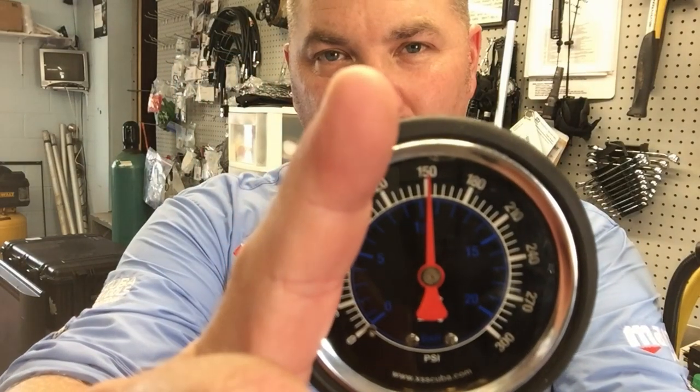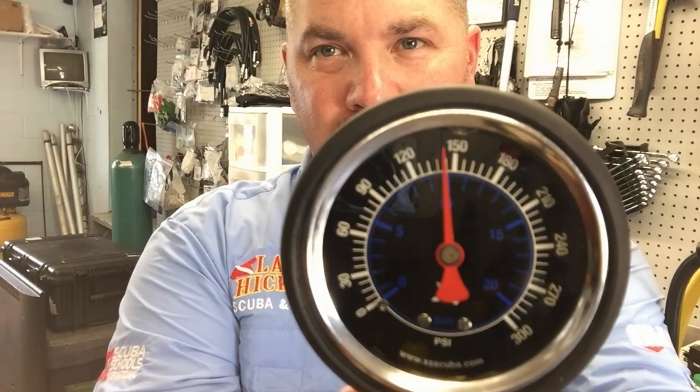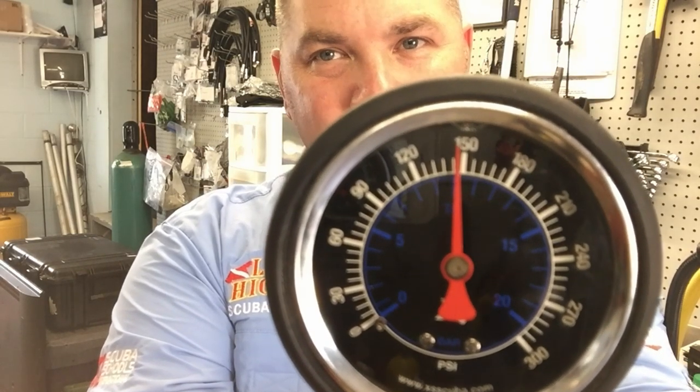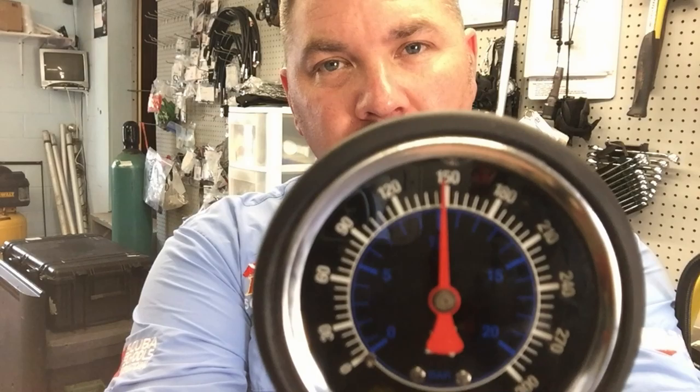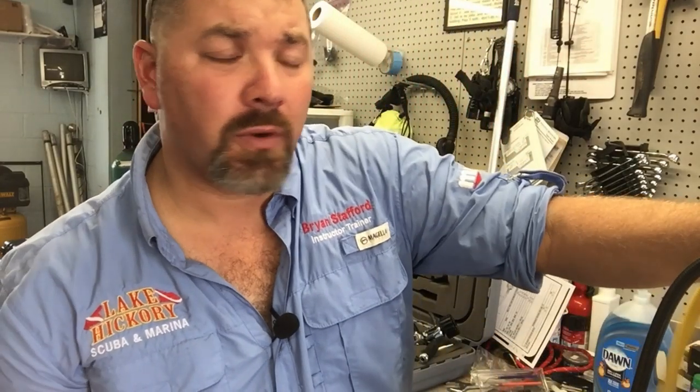We're still climbing — at 10, now 10.5, going on to about 10.6 — and the longer I stand here, that red needle is just going to continue to grow. Watch this: I'm going to take the pressure off. It drops below 10, seems to stabilize, but keep watching — it continues to creep up past 10, to about 10.2, then 10.5 on up. If I sit here long enough it'll go to 11 bar, 12 bar, and eventually you'll have a catastrophic failure in the first or second stage.